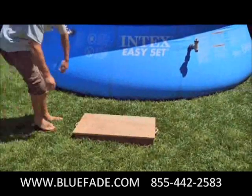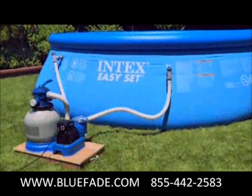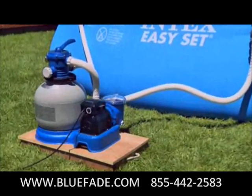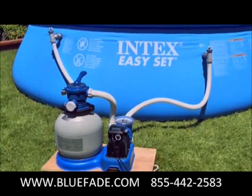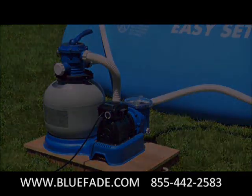Provide a level, stable base which is vibration-free. The water outlet from the pump should face the pool. The filter pump should be as far from the pool as the hoses will allow. Check the location carefully, since the filter will be heavy after it is filled with sand. Good air circulation is important for motor cooling.